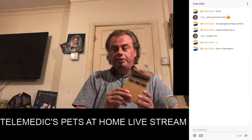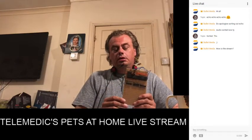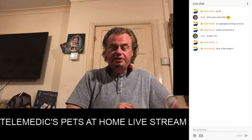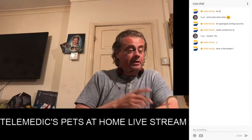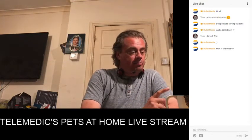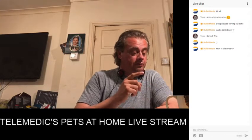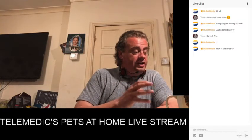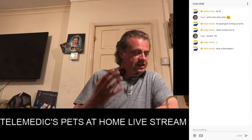So that's the main prototyping board here of the video display, which I actually have up and running. The plan that I've got at this moment is when I've wired these bidirectional buffers up, we can connect these to one of the ROM sockets of the PET, knowing its addressing, steal a read and write line from somewhere else on the memory line somewhere, which I can apply. Bring it in with the CE pin that's available on one of the expansion ROMs, and feed it directly with data. So that's the idea. We can program the RAM and hopefully get a display out. So that's the first start, which I intend to look into so far.